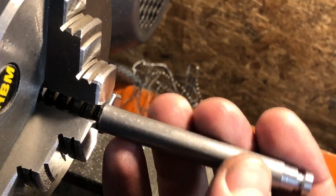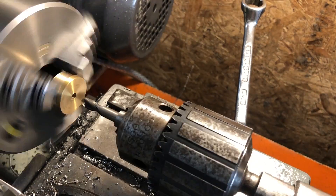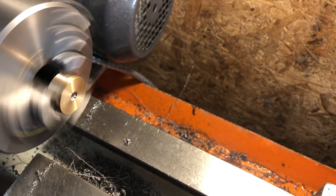With that complete it's back to the lathe for the finishing touches. With the screw still in that hex standoff, adding a slight radius with a file finishes this part. Off camera I have lightly deburred the clamp piece, so the only thing left to do is to complete the parting process, and with that the clamping arrangement is complete. The final operation at the lathe is forming a quarter inch radius in a scrap of brass using a ball nose end mill, to be used as a backer to help riveting the ball handles onto the sector fingers.